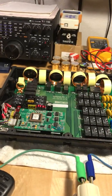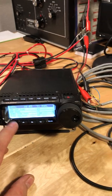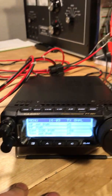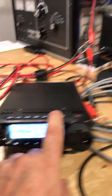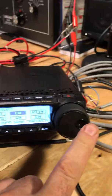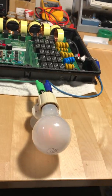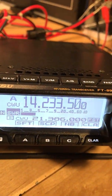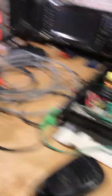The radio has the ASU set — the only way to really control the power is to hold the function key down, go into the menu item called HF power. That's the actual power used when you're on CW. If you hold down on a band switch you can change the mode by spinning the wheel. I have it set to CW. Let's key up — bam, I heard one click, the light bulb lights, SWR 1.01 — perfect. It recalled that frequency from memory, knew exactly what mix of capacitors and inductors to use.